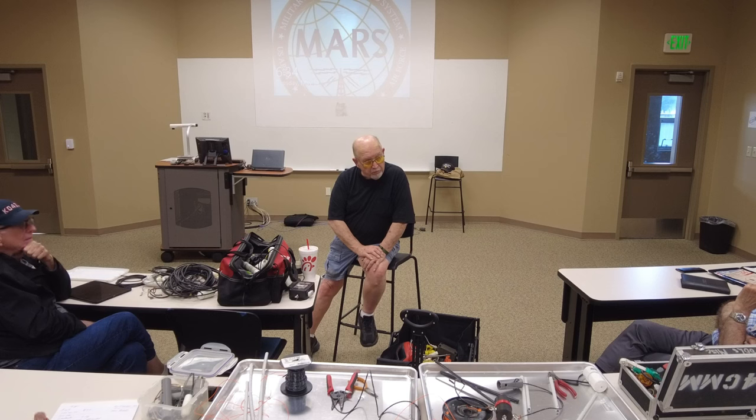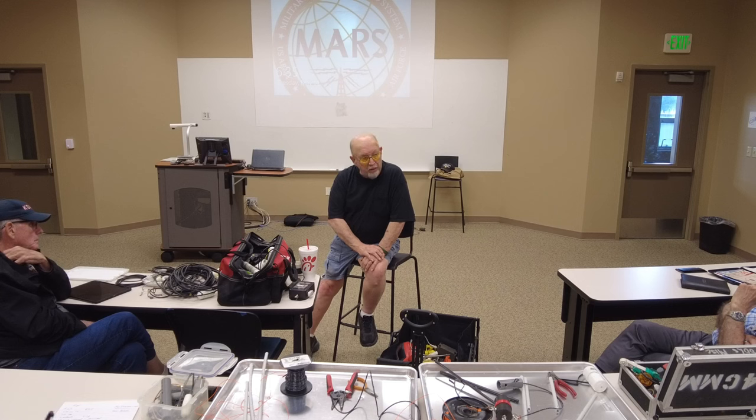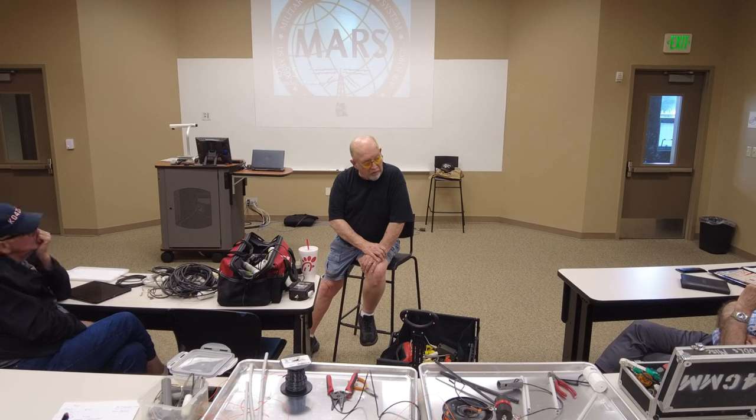Now, any other questions? All right, let's talk about the last antenna I'm going to talk about tonight. It'll be just about right. Horizontal loop. Okay. Horizontal loop is a great antenna if you've got space to put it up. 1005 divided by the frequency in megahertz will give you the full wavelength of the antenna.